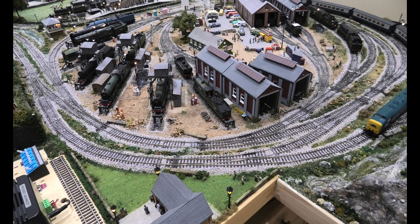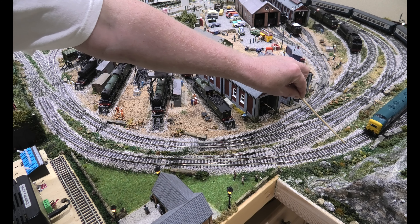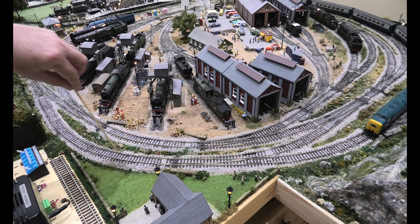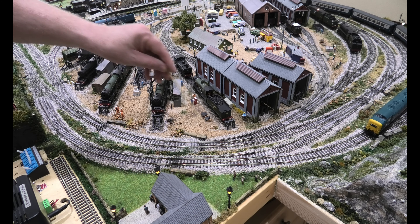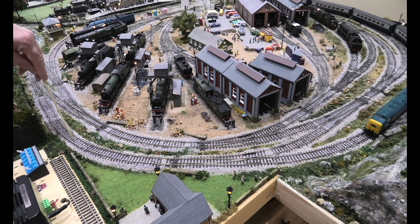Good morning. What we've discovered is a massive fault with our model railway electrics. We've got isolators here because we run both digital and analogue, so there's no power being fed directly to this section. We've got PL11s here feeding the power through normally, but when you're running digital and want to bring a digital locomotive through here, you can't because there's no power.